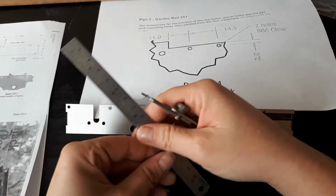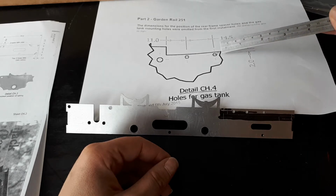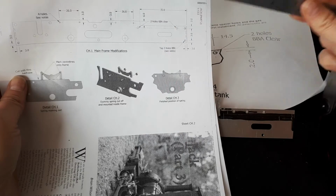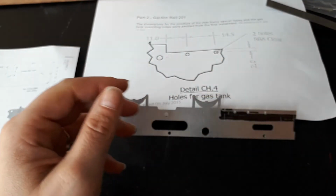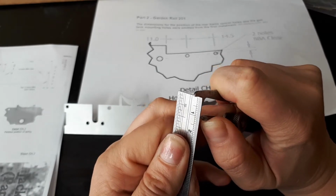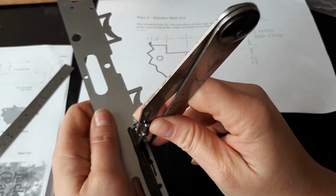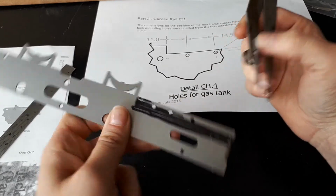Right, we've got to work out how deep it is first, haven't we? Before we mark that, because we haven't done the straight line. So that is 2 millimeters from that section there. That's been cut out. And we know from the original drawing there that we cut out 6 millimeter. So 6 plus 2 is 8. I did work in a bank. I can do maths. That's going to sort of sit. Nice little line there.